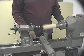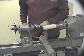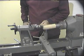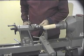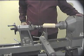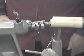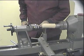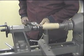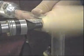You can now see how the Wobble Chuck enables the wood to turn eccentrically. Take the first few cuts, make them light, don't try to remove too much timber at one time, and stop on a regular basis to check on progress. Start the lathe up again and continue with the cuts. Don't try and remove too much timber until we get close to the tail centre and stop.